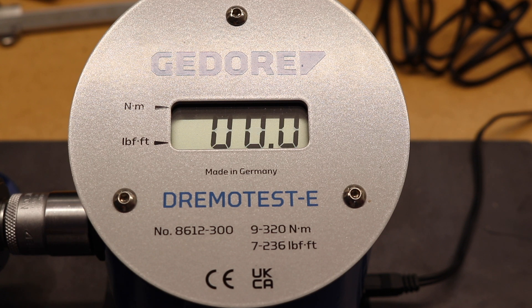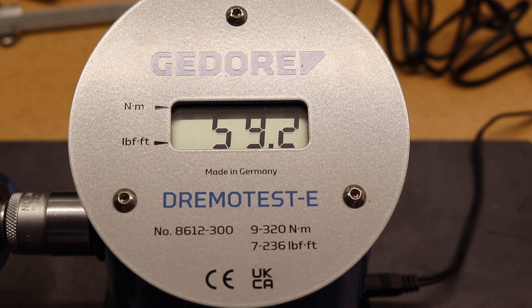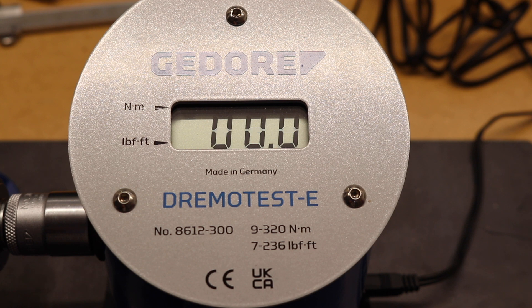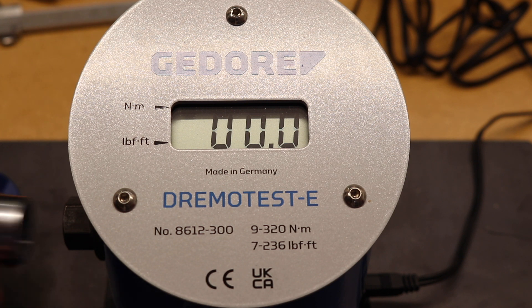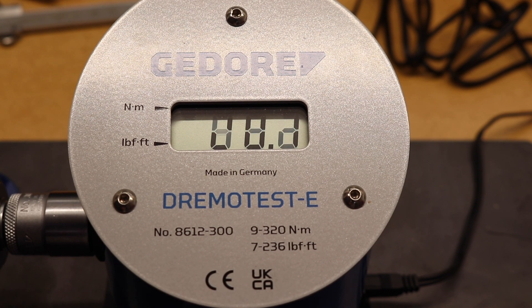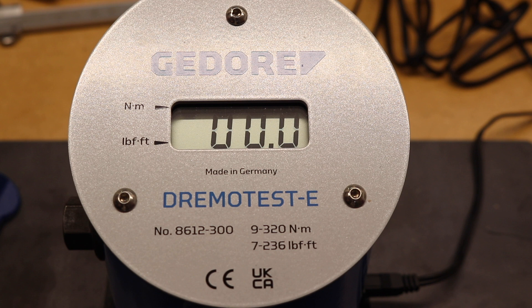What I'm finding is that this wrench reads a little bit lower than the test on my rig. 33.9 is actually just out of spec - it should be plus or minus three percent; it's not out by much. At 60 newton meters: reading 59.2, then 58.6, then 58.6 again - that's actually all within spec; 58.2 is the bottom of spec. I do get it going out of spec sometimes on this one - it's not going to do it when the camera's on it. There - 58.1, so it has gone under spec on that one.